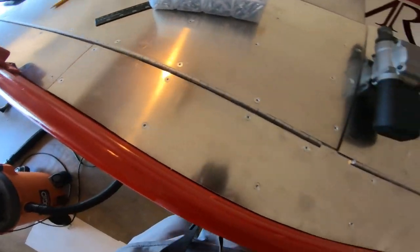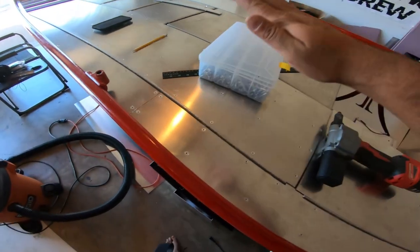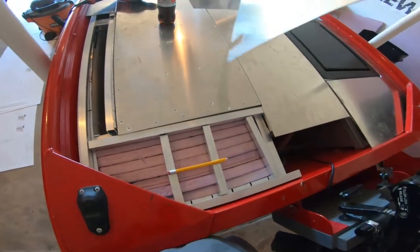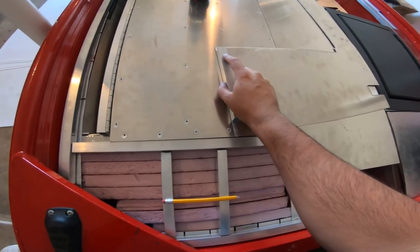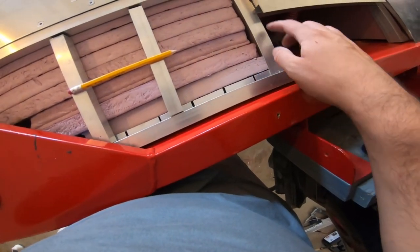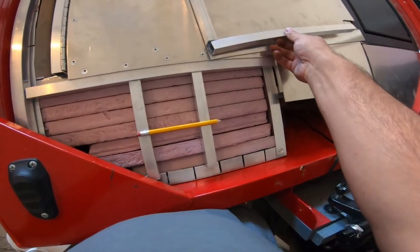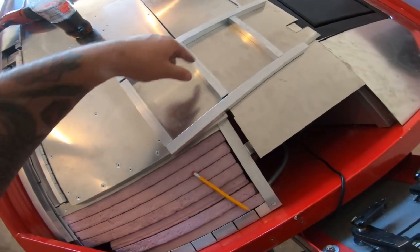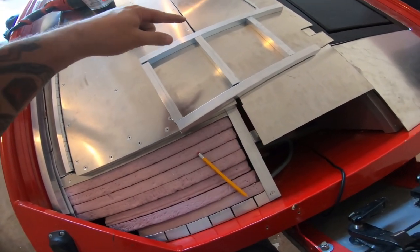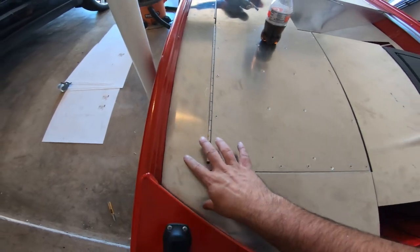There are those two pieces attached, looking freaking sweet. The framing needs to be attached to the metal but I can't get to it because it's all foam behind there. My idea is to trace it out on the back side with a marker, drill all the holes through the back side, and then rivet it into place that way. This other piece will just be attached along the edges — that should be enough to hold everything.